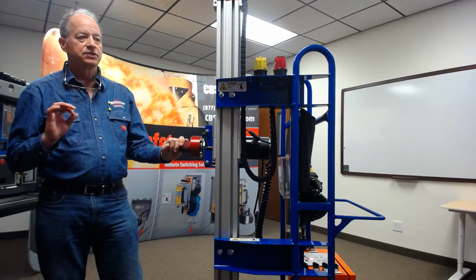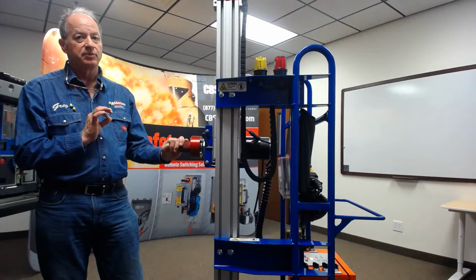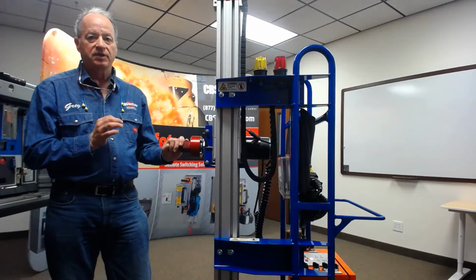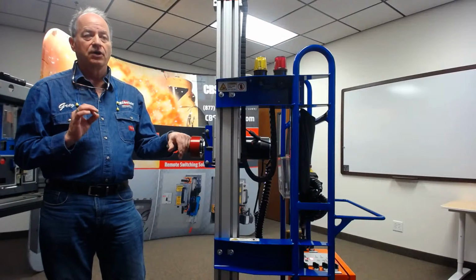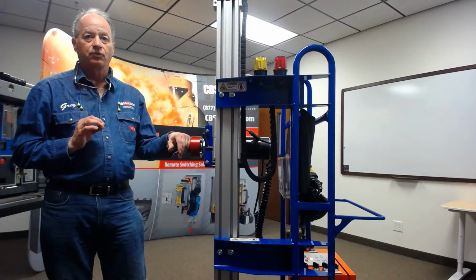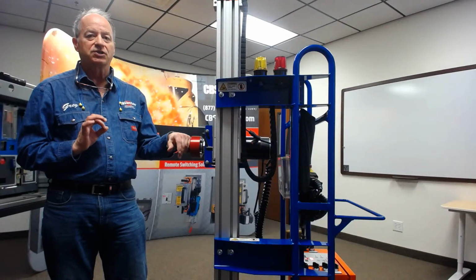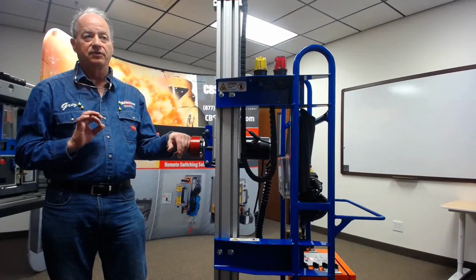One of the things to explain is the RRS-1, while it's an extremely capable system and will do over 240 different types of breakers, let's say you've got a small NEMA enclosure where you can't really fit something like this inside. Our RRS-3 lineup, we would encourage you to look at, because those are able to quickly go into a small enclosed substation or up a flight of stairs with one person carrying them in their hands. The RRS-1 is the lightest universal remote racking system on the market. It weighs under 200 pounds. The next one is anywhere from 250 to 350 pounds.